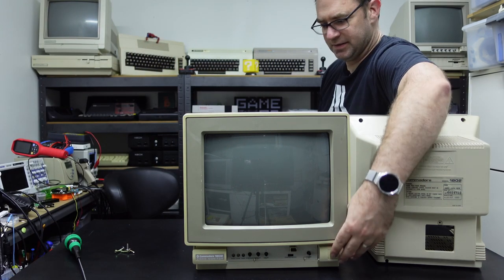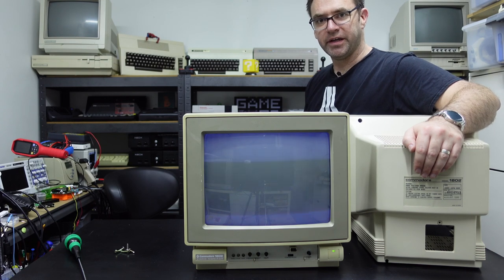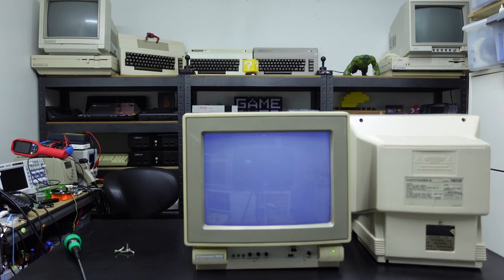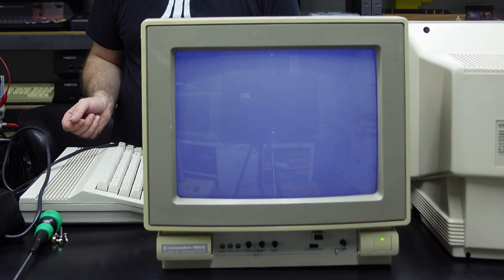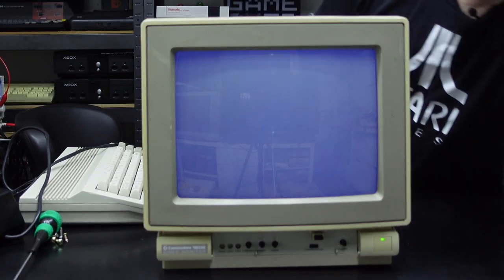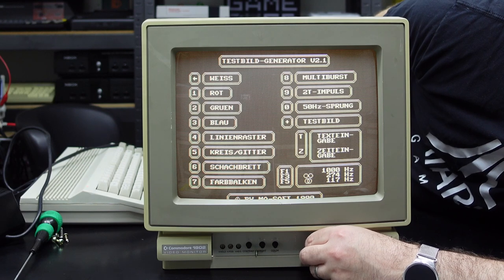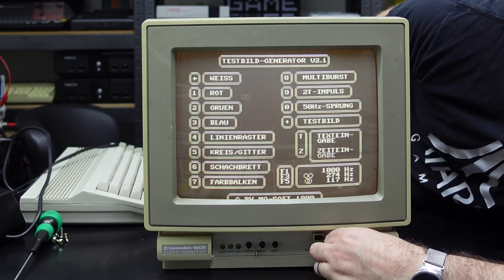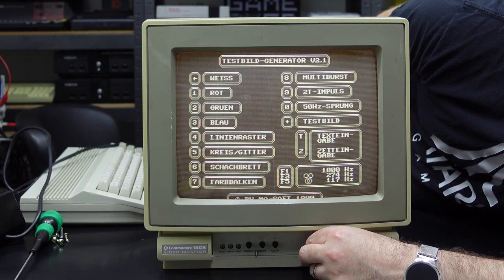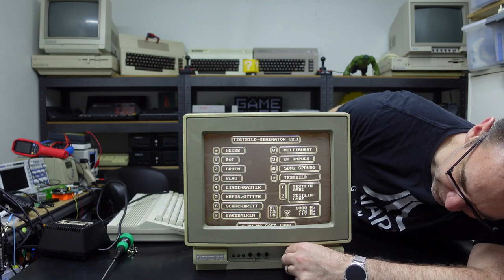We are plugged in. High voltage is still there — that's a good sign. I can see in the camera that we do have an image. Bringing the C64 back out — power on, but nothing. Oh, I'm set to composite. Here we go. Why is that buzzing at me? The speaker's buzzing, but it seems to stop as I jiggle around this switch. The switch is very loose — in fact, it's too loose.